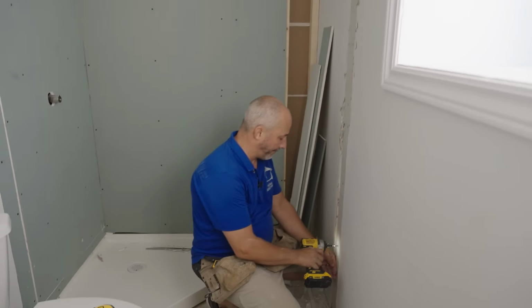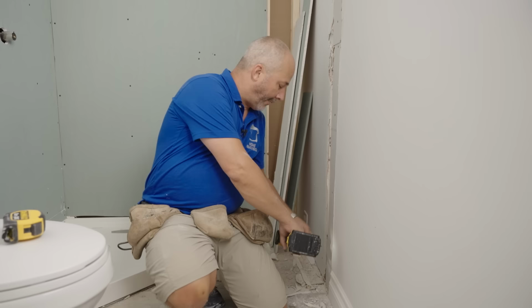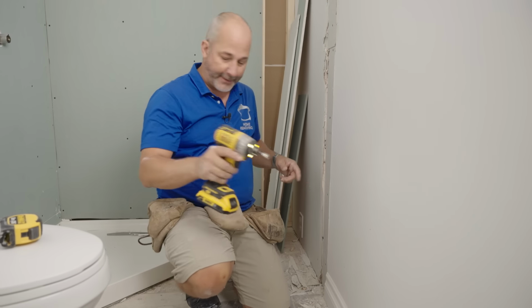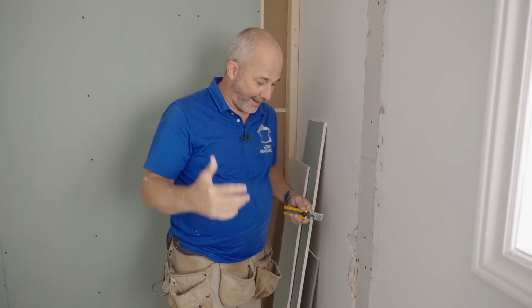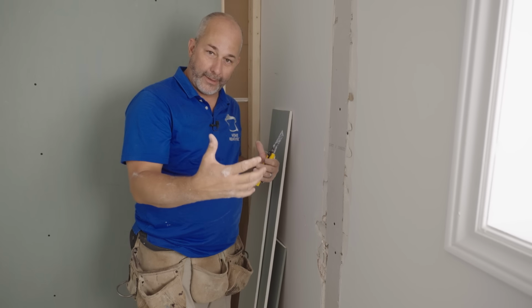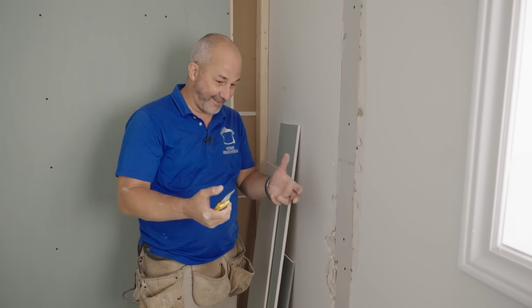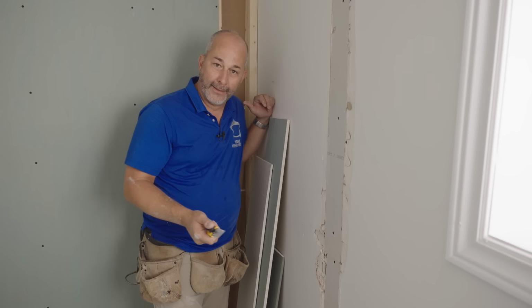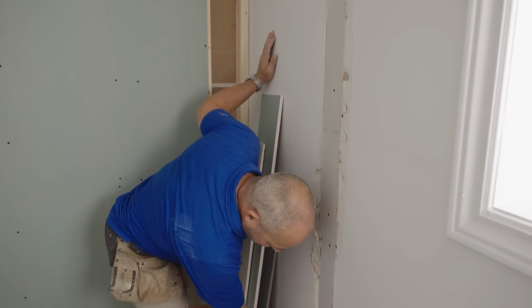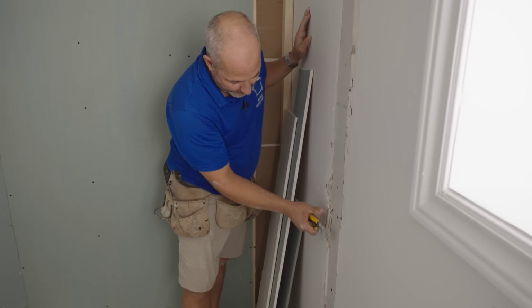There's the backsplash I was doing in the kitchen. It was tile, and I went floor to ceiling, and right at the very end I had to make a modification for my hood fan. So I had to take a tile off the wall. You wouldn't believe how much moisture that wall had sucked out of the adhesive that I was using in order for the adhesive to dry. And then when I took out the tile, it was just like butter. I was blown away. And then within a couple of days, I had to change another tile, and it was solid as a rock again. That is the nature of drywall. It absorbs water and it releases water.